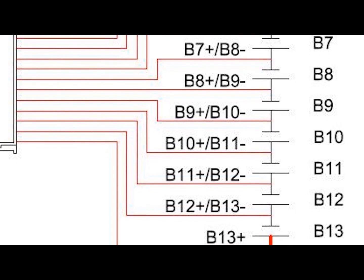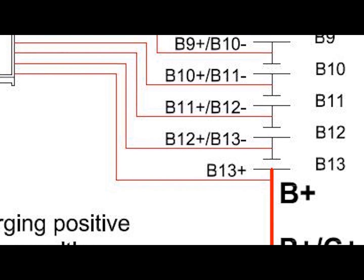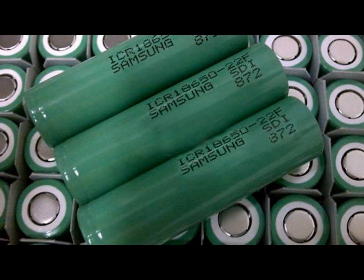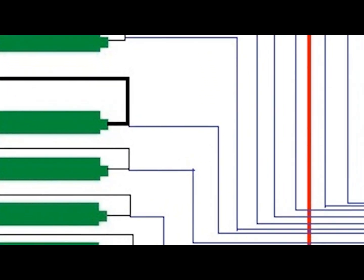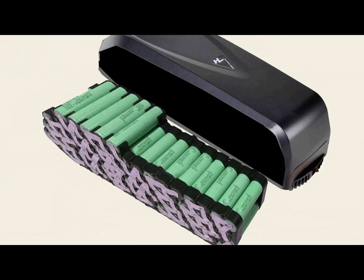The BMS is controlling items such as voltage — total voltage or voltage of individual cells — temperature, average temperature or temperatures of individual cells, state of charge or depth of discharge to indicate the charge level of the battery, its state of health, a variously defined measurement of the overall condition of the battery, and the current in or current out of the battery.